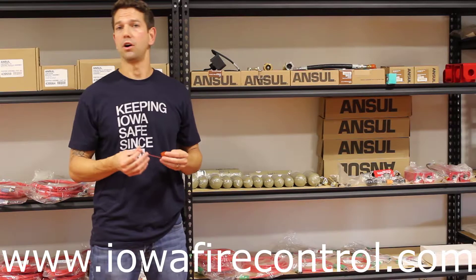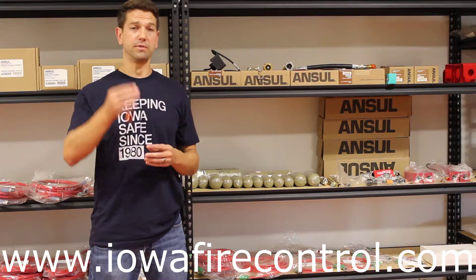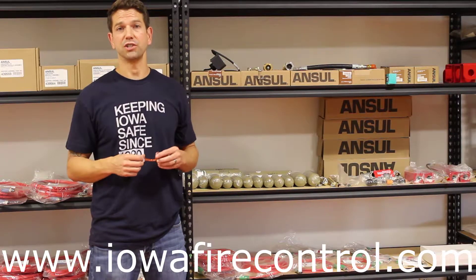These are the first line of defense against those nozzles being damaged. So it's very important to do a simple quick check on your machine. If you were to see a nozzle on that vehicle fire suppression unit and you saw that it was hanging off or removed, whatever it might be, make sure you call your fire suppression, fire protection coordinator.